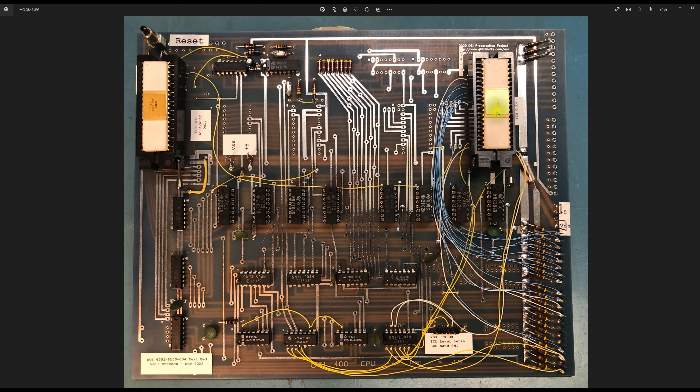From the TIM prompt, we can look at memory. Typing M 0100 dumps eight bytes at address 0100 — that's just random content in memory, shown in hex. Using a colon at this point lets us modify memory. With M 0100 followed by a colon, we can enter new bytes starting at address 0100, and TIM does a full write-and-verify on each byte. Doing M 0100 again confirms the new values. Then M 0108 gets us the next eight bytes, and we can use colon to change those as well.